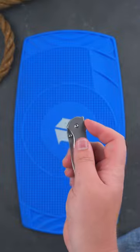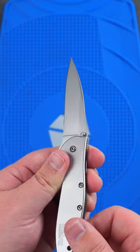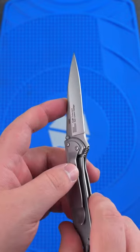The hollow grind. This one tapers with an inward curve, creating a very thin edge. A lot of EDC knives have this grind because it glides through paper and packaging, although its edge is more susceptible to chipping than the thicker grinds.